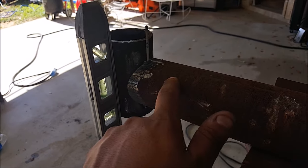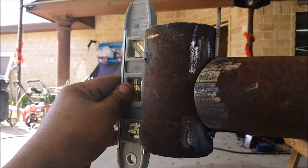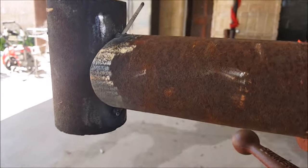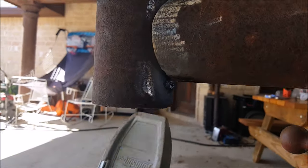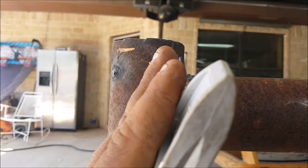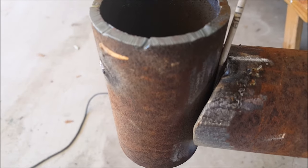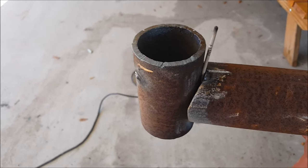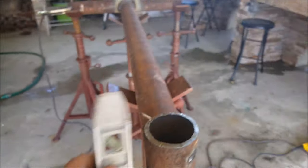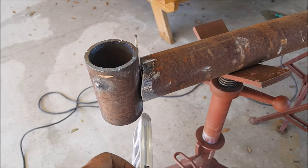I'm at the end of this piece here and I couldn't get it level one-handed, so what I ended up doing was putting a level on one side and making a small mark on top of the pipe — that was where I wanted this pipe to sit. On the bottom side I opened up the gap a little bit and gave it a small tack weld so I was able to move the pipe inward and position it where I wanted it. This small 3/32 welding rod is basically the gap that's going to remain. I'm level on both sides, so I'm going to put a tack weld on top and on the bottom and one on each side, then weld it up.